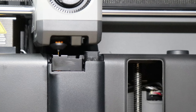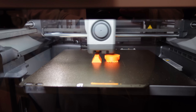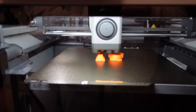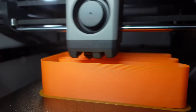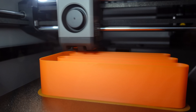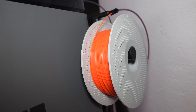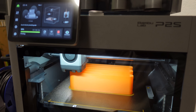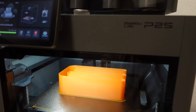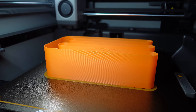I can see it is extruding. Now let's repeat the printings — E3D nozzle using the same G-code. Looks like it passed that critical point. First signs of under extrusion, but it will be finished in less than one minute. Almost maximal flow. It's finished. Now I can see some under extrusion at the end but I will analyze it later.